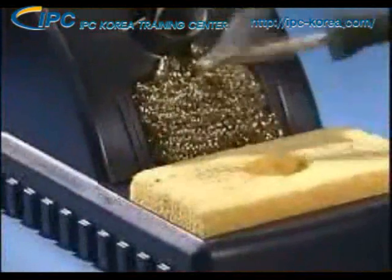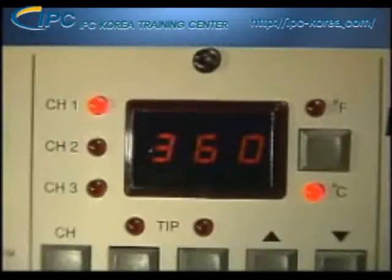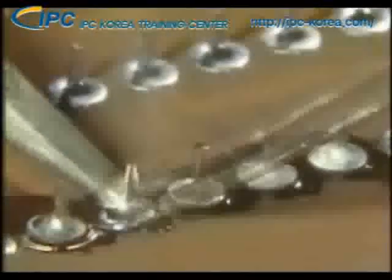The brass pad is the preferred method of cleaning the soldering iron tip, because the temperature will not rise and fall. The other problem with excessive tip temperatures is that the higher the tip temperature, the faster that oxidation will take place.